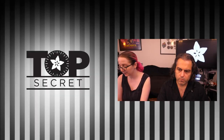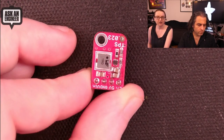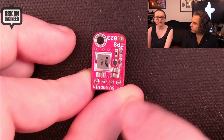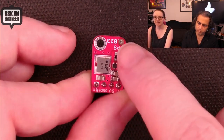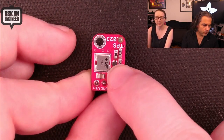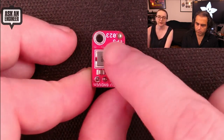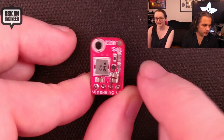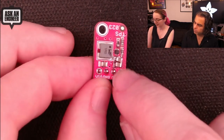So the first item is a little breakout board, which I even designed on The Great Search. I'm talking about getting these really cute new boost converters from TI. This is the TPS — you can't see this under the fiducial — it's 61023. That's a little boost converter, and this will give you 5-volt output from about 3.5-volt input. So I made this little mini micro power boost, like a mini boost breakout board. You just have 2 to 5 volts in, 5 volts out, and then an enable pin.